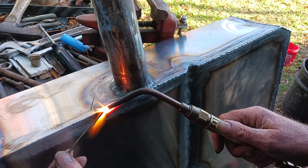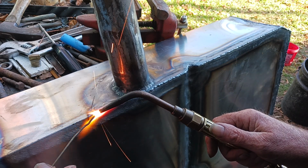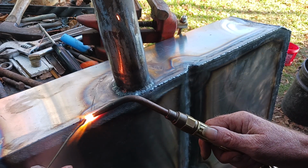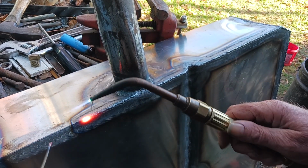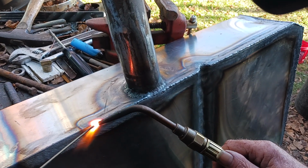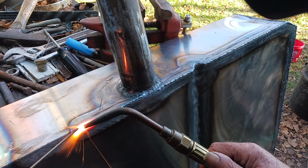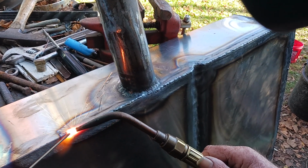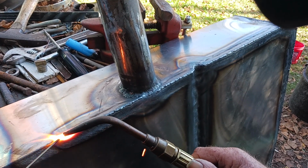That way the tank coat will be good and dry by next spring, because this time of year, the tank coat I use is the stuff I have, which was like $65 for a can. I've had it 6 or 7 years, and it's a red fiberglass tank coat. Horrible stuff, but it works. It should be 100 degrees for a month when you use it, because it takes forever to dry. But if it sits all winter, it'll be dry by spring.